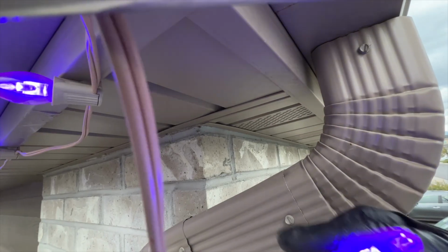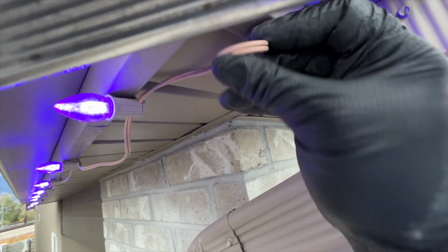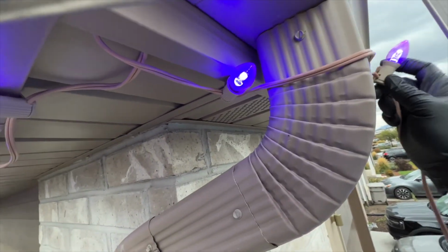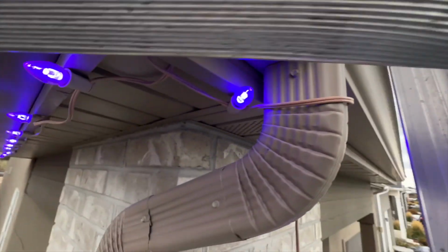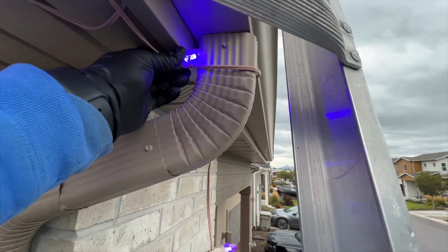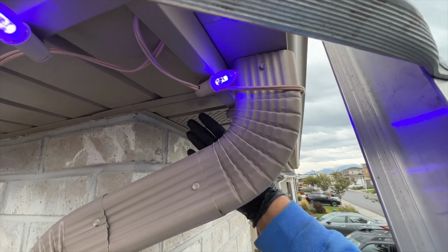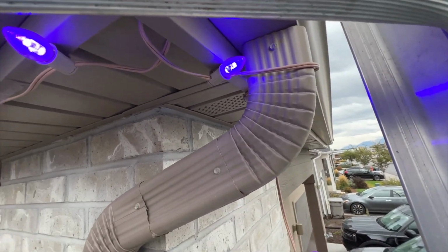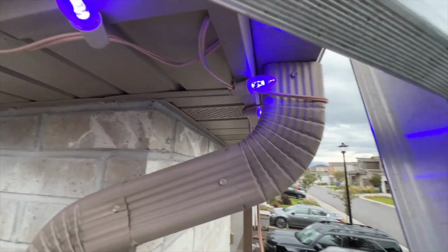Okay, so now I'm here at a gutter, and what I'm going to do is show you my little trick. So we'll tuck this side in, kind of like that, and then I go around the gutter like this. See that? And the fact that this strand matches so good, nobody really will notice. So I go around the gutter rather than bringing my whole spool underneath there, which a lot of new guys do as well. I used to do it when I first started because I thought that was the cleanest, smoothest way. But once I started doing this, it's faster and it's perfect.